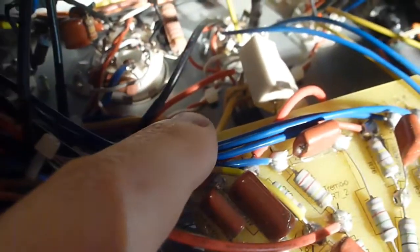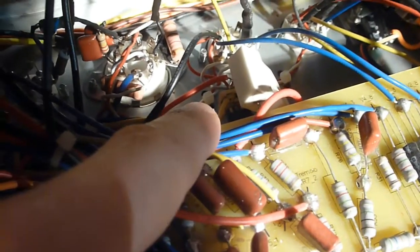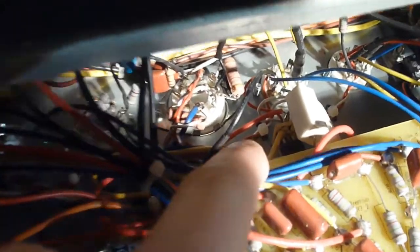The potentiometer over here goes to one of the pins on there, and then the circuit runs across it. But there shouldn't be any way for that to actually short out, because if you look in the schematic, there's no connection between there and ground for it to short directly to. So I have to imagine that there's actually just a straight short.